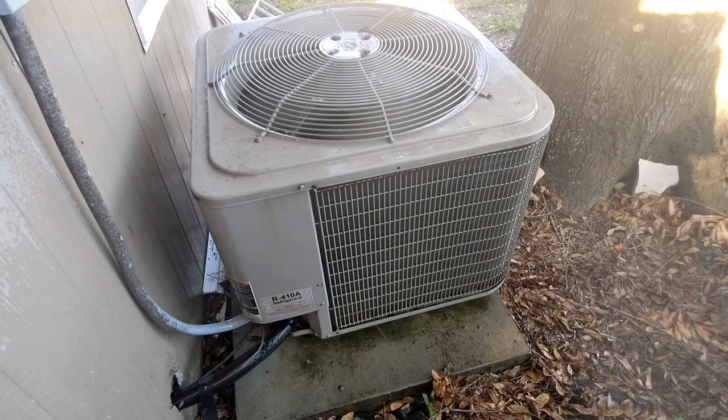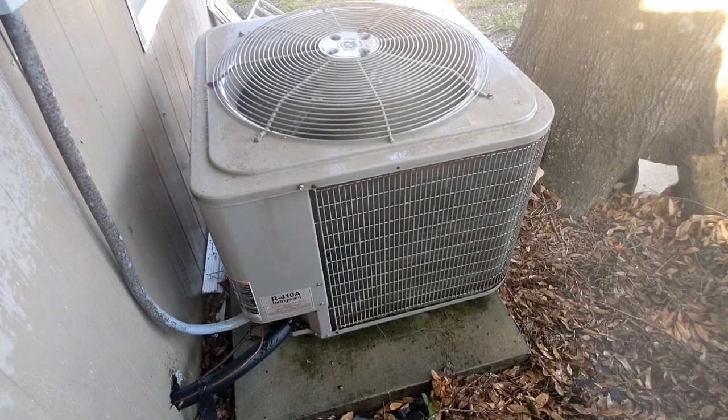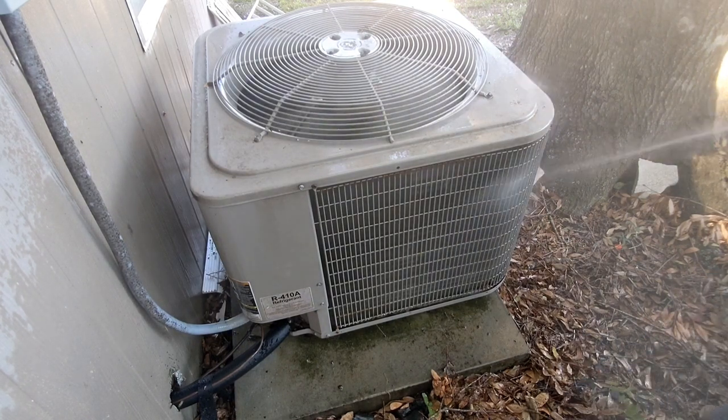Inside the louvers. It's really, really unusual to push more stuff inside the coil. In 20-something years, I've only ever had to take maybe three of them apart to really clean them, and they were usually around a lot of dogs that dug holes by the unit or next to dryer vents. The dryer lint gets sucked into them. But this is a good homeowner way to do this without getting yourself cut.